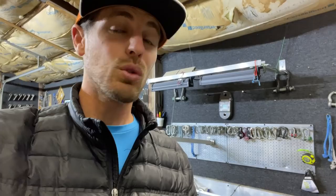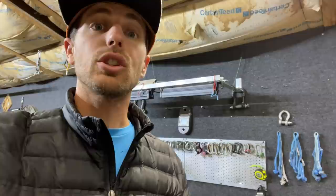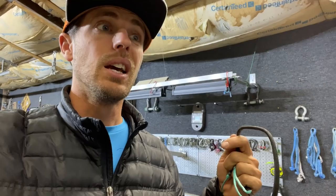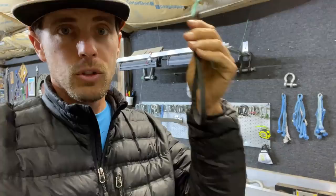Then I pulled it again and got 36 kilonewtons to get full destruction of this sling — which is crazy because one of the three strands broke at 41 and then it took 36 to finish coming undone. That's really high force for what this is. It's kind of crazy how much variability we're getting depending on how we use it. On a boat, loaded at low enough force often enough, it should settle to get maximum strength. I also found that cyclically loading a soft shackle slowly got me 48-49 kilonewtons versus 34 kilonewtons otherwise — dyneema likes being cyclically loaded. If you girth hitch this or attach it any other way than straight on two big shackles, you'll probably get half. Let us know in the comments what you want to see next. Cheers.